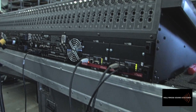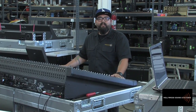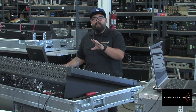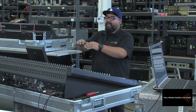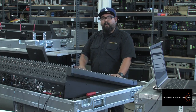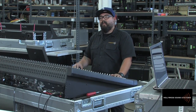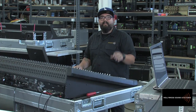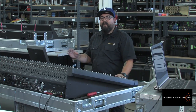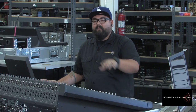What we've done is taken this PM5D — if you take a look at the back of the mixer here — we put in two Dante cards, giving us 32 channels for now, without needing a huge mass snake or taking up every single input. Because we're working on a non-RH version of the Yamaha PM5D, we now technically have recallable head amps, running the Rio boxes that come with Yamaha's CL5 and Dante-compatible consoles.